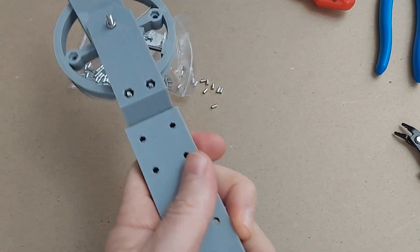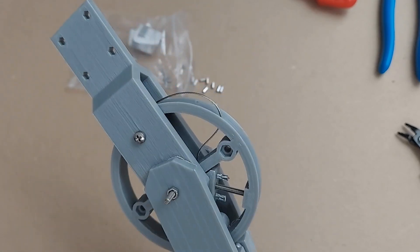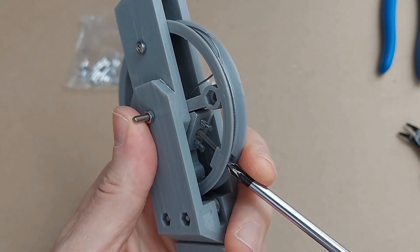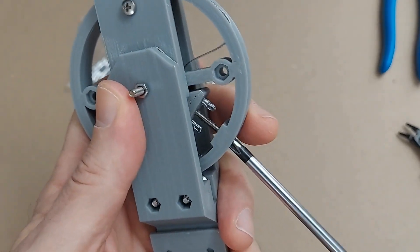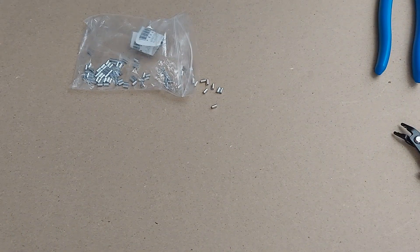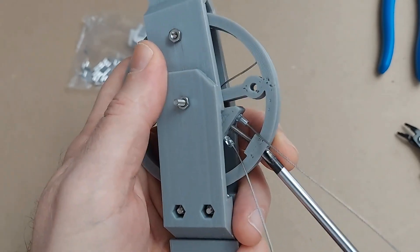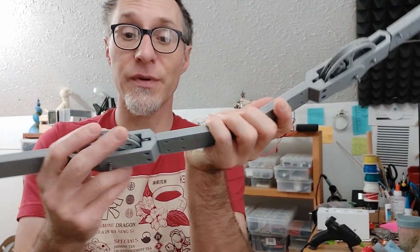You can see the whole thing is quite a bit goofy if I try to move it — there's just a lot of slack in the system. You can see the cable puffs out because of the amount of slack, so we've got to tighten that up. Starting with this trolley, I'm going to wind it out and you can see the trolley moving towards the rim and pulling up that slack. Then flip this around and do the other side, adjusting it to pull up the slack. Okay — that's all assembled, I've got two different pulleys with cable drives connecting them.